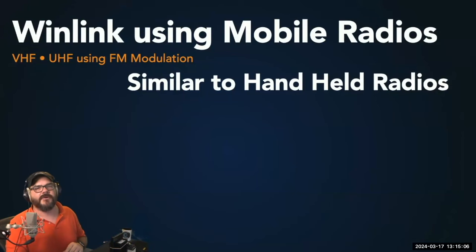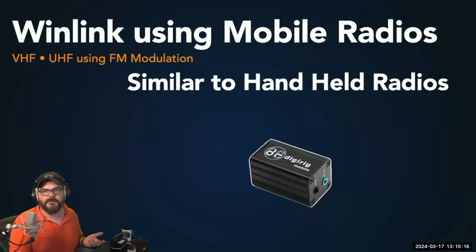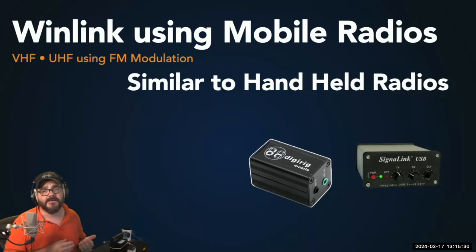Mobile radios are very similar to handhelds, and when using them with WinLink you'll use many of the same tools. DigiRigs are great because you can connect a variety of different radios just by swapping cables. The SignalLink is another very common one — it's a USB external sound card with controls on the front of the unit, which is nice compared to the DigiRig where you do everything inside the software. With the SignalLink you can change internal jumpers to map it to various radios and just swap cables, making it a very flexible device.